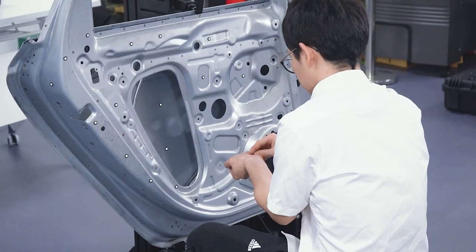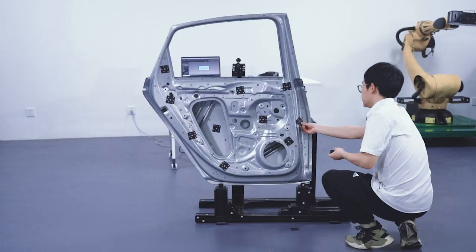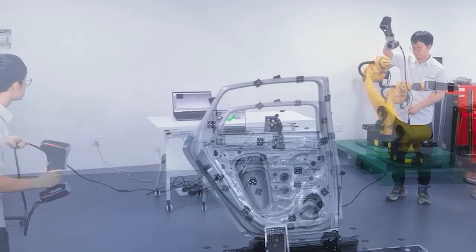But what if the object to be scanned is very large, such as more than 2 meters — how does the 3D scanner handle it? The scanner also has a built-in large area photogrammetry system, which is a great helper. With reference bars and coded targets, it positions targets accurately to construct a general geometry of the object. The details of the object's surface can then be captured using the scanner to get a high-accuracy model.